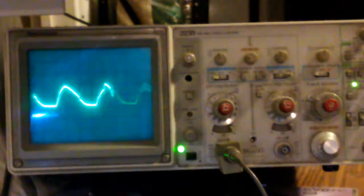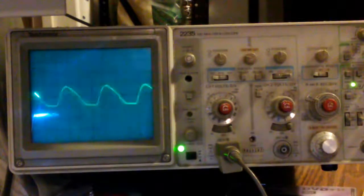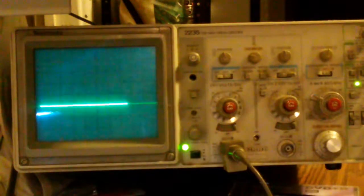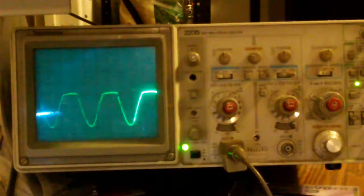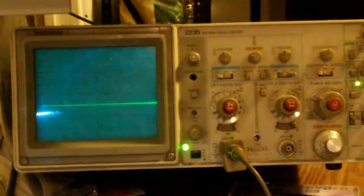That's all it's doing. This tells us that there's no filtering capacitor on the other side, and apparently that is what the batteries are for. With the battery in, before the diode we're clipping off the very top of that sine wave — that clipping is probably when we're charging the batteries. Basically, this means you can only run the calculator with the batteries in.